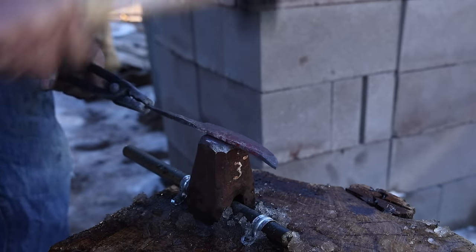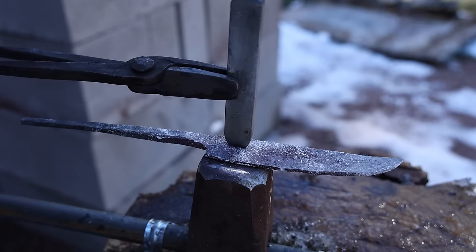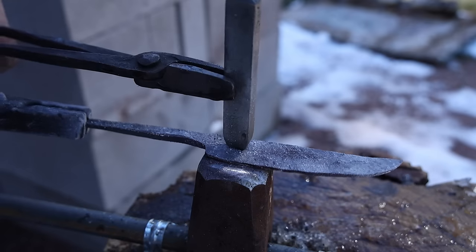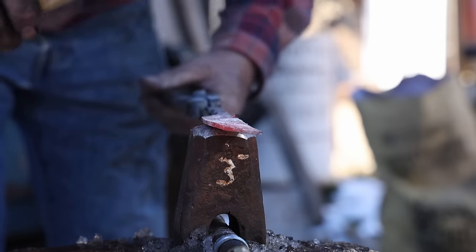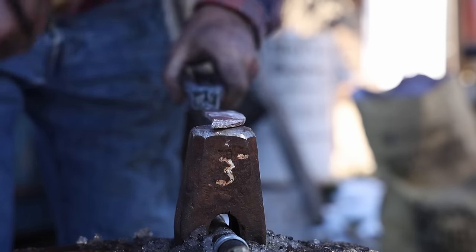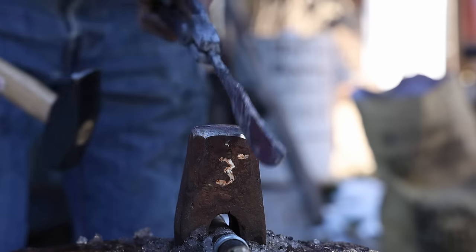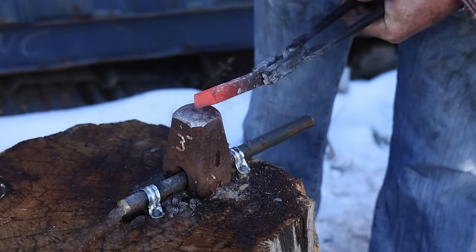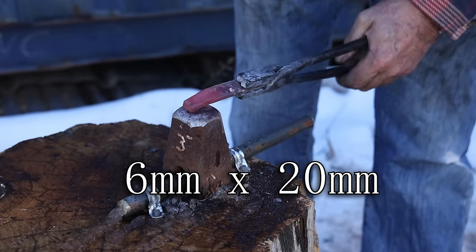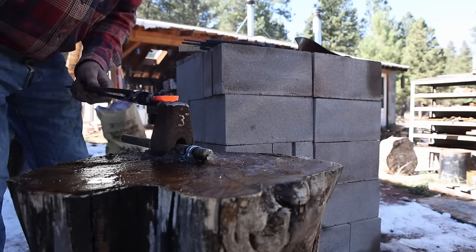I'm going to go ahead and put my touch mark in this. A little tough to balance it up on that little anvil, but it can be done. I want this as straight as I can get it, but you can do some light straightening cold in a vise or something. Now I want to work on the guard — just a piece of quarter by three-quarter mild steel — and I'm going to draw it out similar to making the tang on the knife, except this time I want it centered, so there'll be a little bit of back and forth trying to center that up.